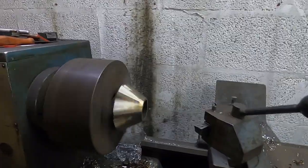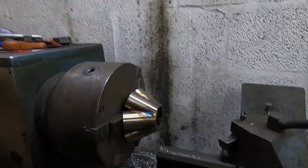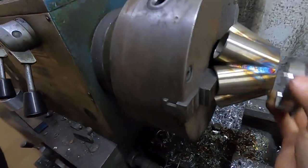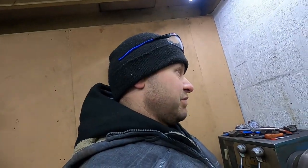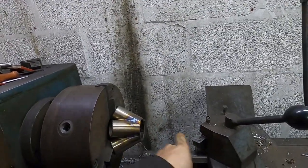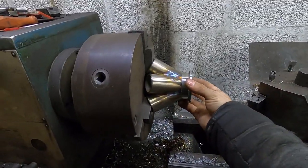This is the result — it's completely spot on. I did chop this with the angle grinder, doing a smaller diameter first and then shaving it down bit by bit until we match the internal diameter of the flange. As you can see we're still a little bit far away, but now that I have it on the lathe — it's all of them in exactly the same place relative to the central axis — I can just mill it down with the cutters and match perfectly to the flange. First time doing a merge collector into a 6-1 v-band and I love it.